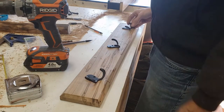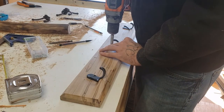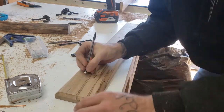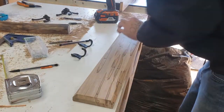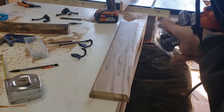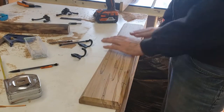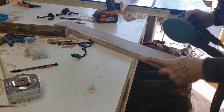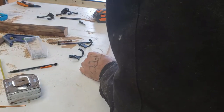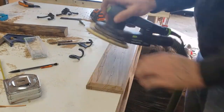Now this is a center-finding drill bit, and I'm drilling just a little bit — not that deep — so that the screws have something to bite into. Then I erase the pencil marks, come back, give it a nice once-over real quick. I didn't really like the way that the trim router had cleaned up the edges, so I ran it again. And there was still a spot where it had a little divot, so I decided to just grab the sander and run it along the profiles — being really careful not to round over any edges, because sanding at an angle like that it's hard to maintain perfectly even pressure. It can very quickly round over your edge and you lose that crisp line. But it turned out all right.